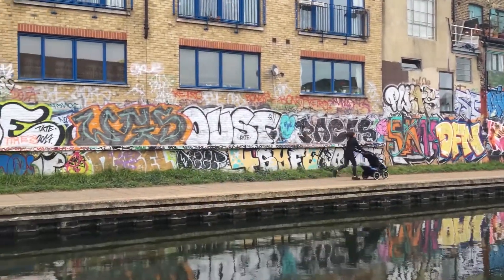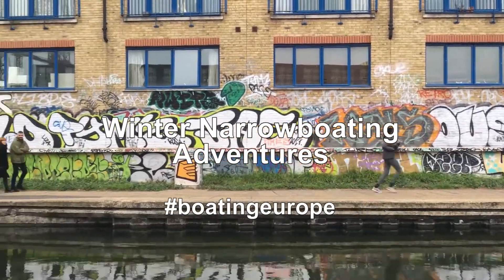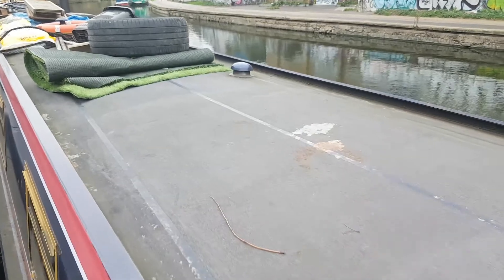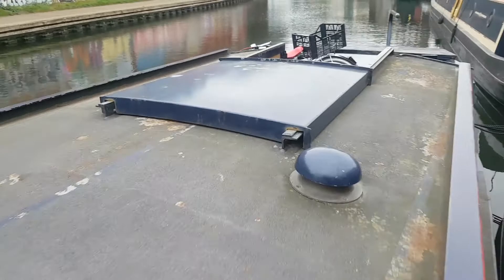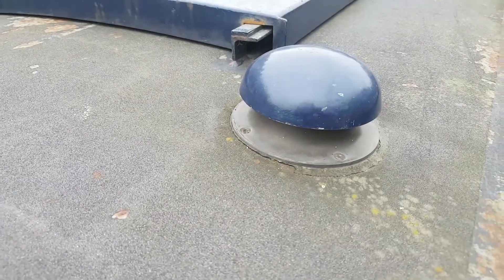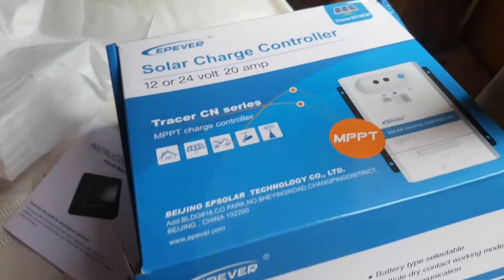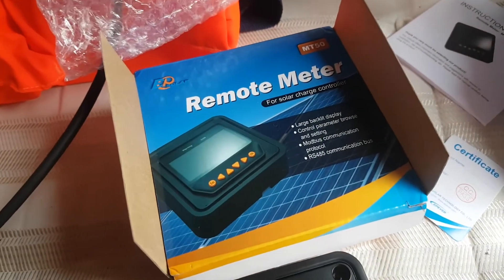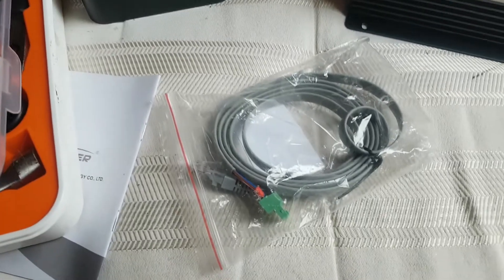While looking after the boat we decided to install some solar panels. The panels haven't arrived yet, we just got the electronics, but a 300-watt panel will go on here. The cables go down to this mushroom vent, saving us having to drill a new hole. We have all the MPPT charge controller pieces — a 20-amp charge controller from Bimble Solar, which is usually quite reliable — and we've got the remote meter which tells you how many amps you're getting and the battery voltage.